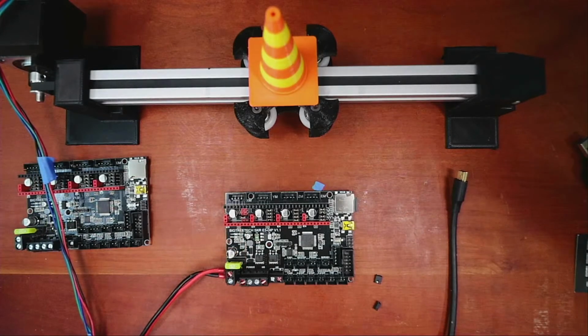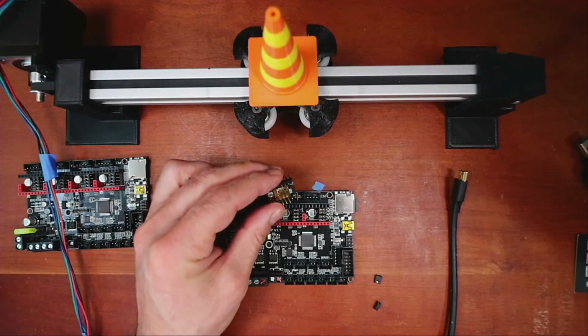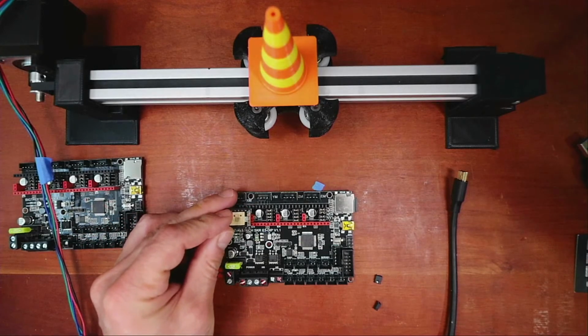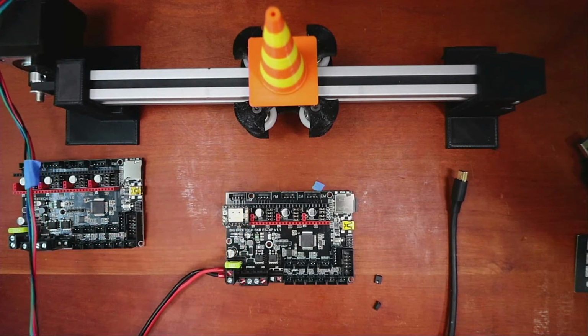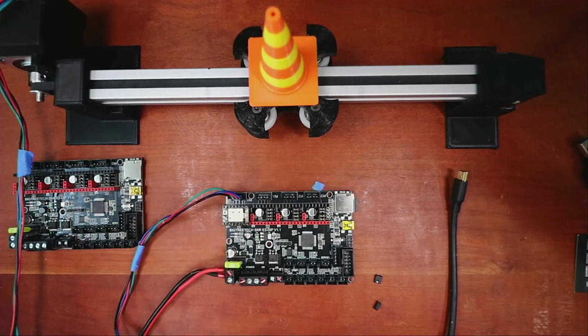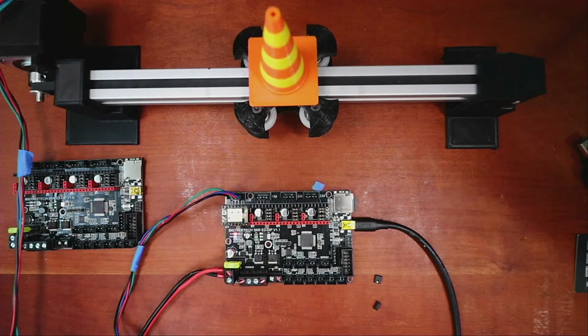And now we'll put in the actual stepper. So I got to find one. So here's the stepper. It's a TMC2208 version 3. We're going to match it by color, knowing that the enable pin's over by my finger. And then we'll apply some thumb pressure to put it in place. Next, we'll connect the stepper cable. And then we'll connect the USB. And finally, we'll reconnect the power and see what happens. Hopefully no smoke. So that looks good for the moment.